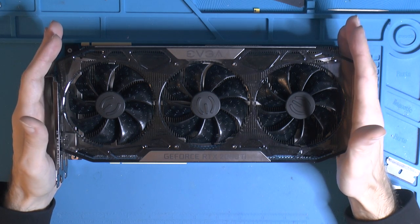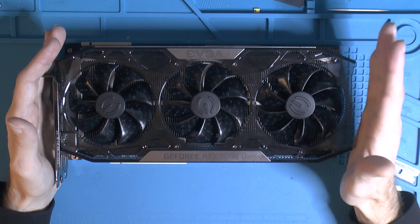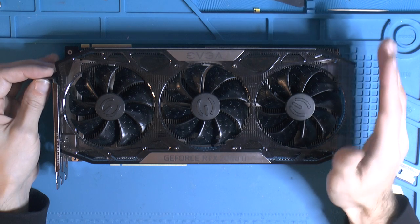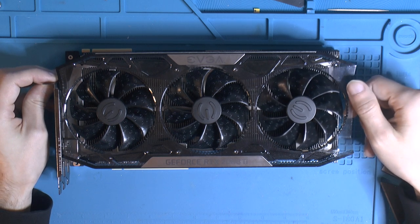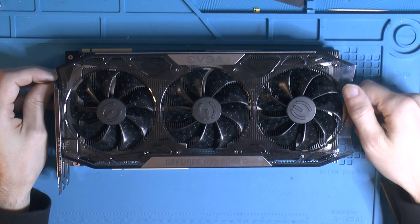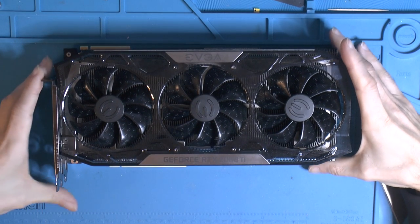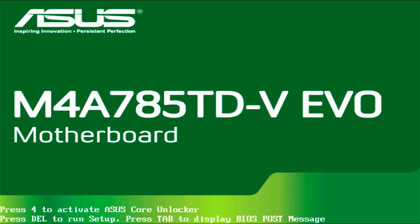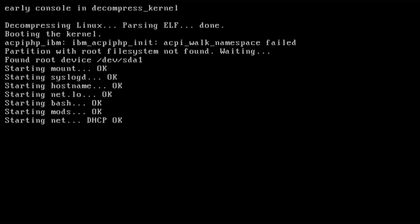So let's start up this card with this Mats and Mods 2. I'm gonna post a link in the description to the other YouTuber. He has download links and a guide for it, so I don't have to make a 25 minute guide like he did. You can watch his if you want to figure out how to make your own bootable Mats and Mods stick to look for bad RAM and stuff like that on your Nvidia card. So we're gonna boot up Nvidia Mats from a USB stick. It's gonna help us find out what memory module on the card is bad, or modules if we have multiples.